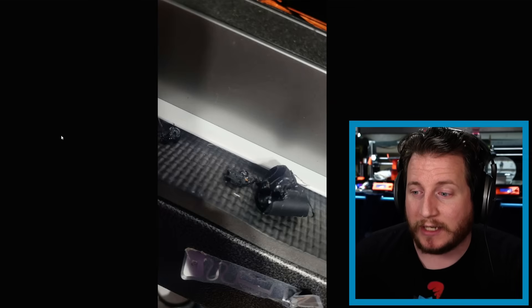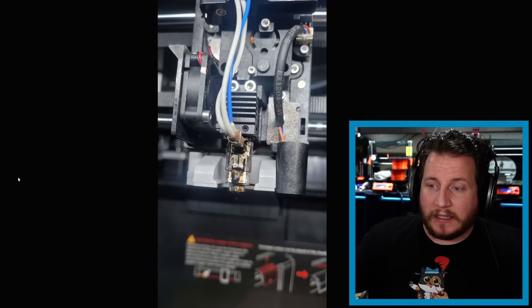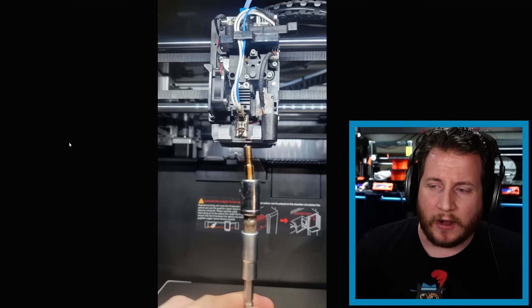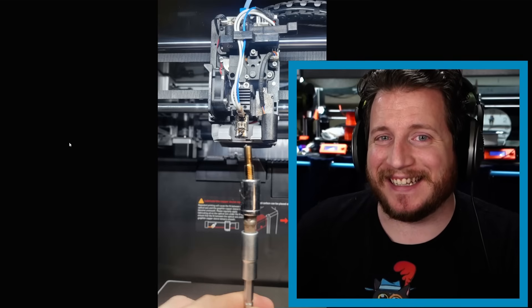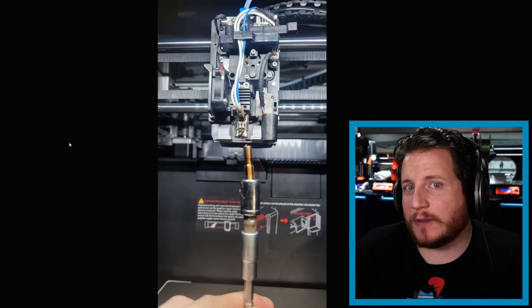What I didn't realize is that the ceramic is incredibly brittle and can break off at a moment's notice, even in the middle of a print. I came back to a print that was completely globbed over the hot end, and as you notice in this first photo, I'm holding the nozzle but missing the heat break — the heat break is still in the printer. That's been a fun one to deal with.